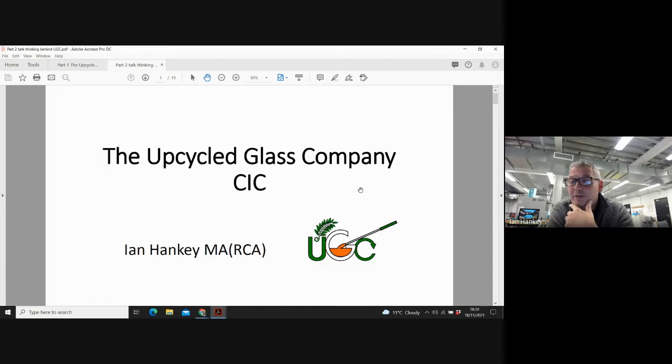And that's the lovely thing about this. However, if you put boron in there, you've got a very aggressively corrosive glass, which is why the furnace I've created, you can take the pot out in half an hour and put another one in. Rather like the Fab Lab here, we've got a 3D printer over there that runs on liquid resin. You've got a tank of white, a tank of black, a tank of clear resin, there are castable resins. So you basically change the tank for that material. What I want to do is have a load of pots, and I just put the pot that's right for that particular glass type, if you know what I mean.